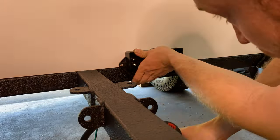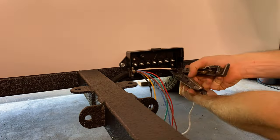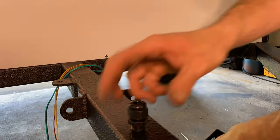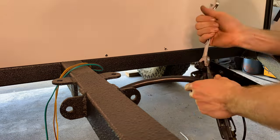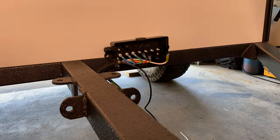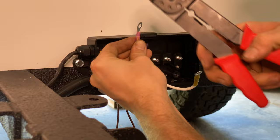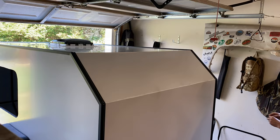The seven-pin wiring harness I bought was way too long so I had to shorten it — got the box mounted, figured out the length I needed, cut it, and started shortening the wires by putting new eyelets on them and placing them on the correct studs. If you're looking for wiring diagrams, I'll share a web page in the description because there can be a few different color codes depending on what product you get, so rather than tell you exactly how I did it I'll leave that resource there since yours could be different from mine.